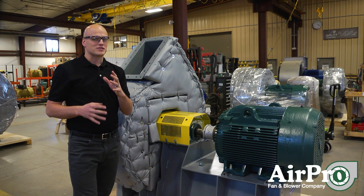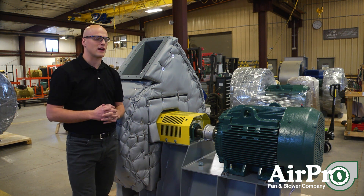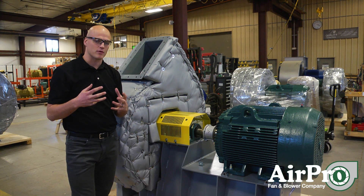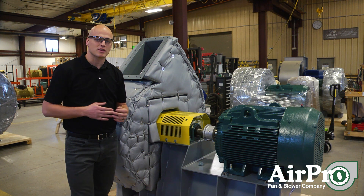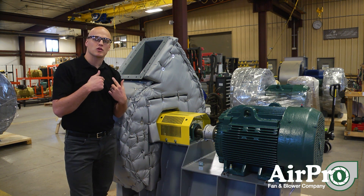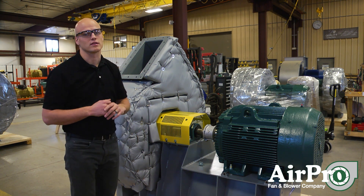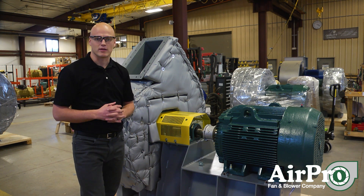On the inside of this fan there's a wheel and that wheel is going to be running at high speeds. That wheel is designed to last for a very long time, but the better you maintain it the longer it will last. The most common issue is that the wheel can fall out of vibration balance — that could be a result of mild particulate corrosives going through your wheel, getting corroded, or building up on blades. So check your wheel periodically; you may have an access door or may have to look through the inlet, but check your wheel to make sure it's clean, not corroding, and within balance.